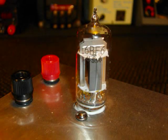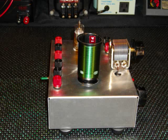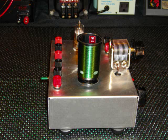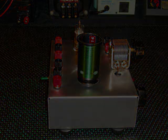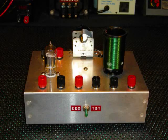The received signal was fed into a single tube, which served as both a detector for AM and an amplifier for all modes. The output signal was then fed into a separate coil, wound on the same bakelite form as the antenna coil and in close proximity. This tickler coil, as it is known, allows for inductive coupling to take place, where a small amount of signal is reintroduced many times over back into the tuned circuit input.